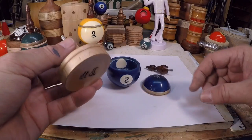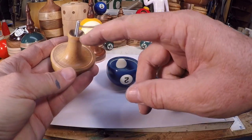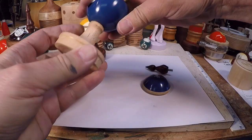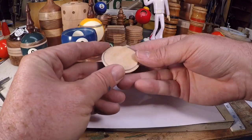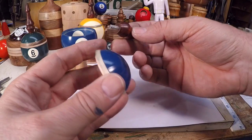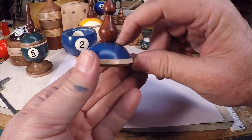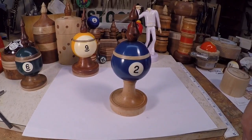Parts are done. I turned this maple base off camera — the only thing I'd point out is that I cupped out the top so that when I apply it to the bottom of the trinket box it has a line contact, a nice contact with the bottom. The top turned out pretty nice and has a good fit with the bottom. You can see the cupped-out detail on the finial — when I turn that down it too will have a line contact with the sphere. It's a nice tight fit. The job is done.